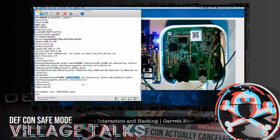Sometimes this will involve experimentation. The first time when I was setting this up to identify it, that's when I found out that this boot arg segment doesn't work, and then you need to do it some other way. And then it turned out it was the standard boot args. So to go ahead and do this, again, you set the environment, which was std boot args.